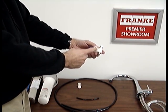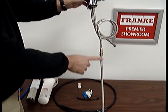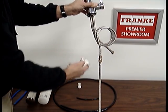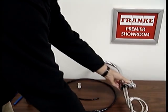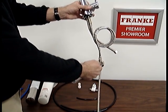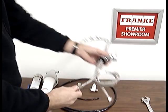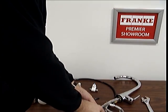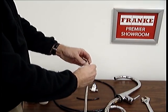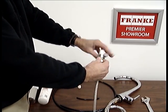The 10-300 kit comes with this shutoff valve, which is an inline valve. You'll take your existing faucet, which has a water supply line from your home, and you'll actually tap into that with this new shutoff valve. The first thing you want to do is remove that line — take a wrench and loosen that up. One side will be male, one side will be female. Put that on there.